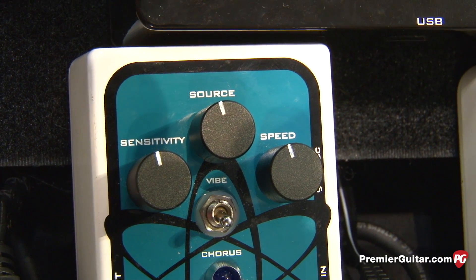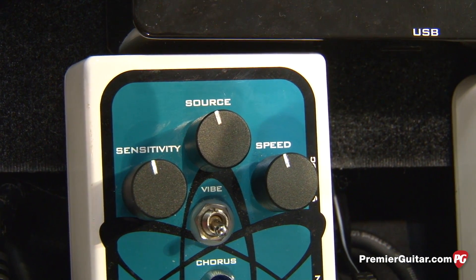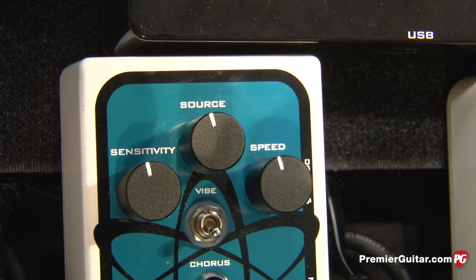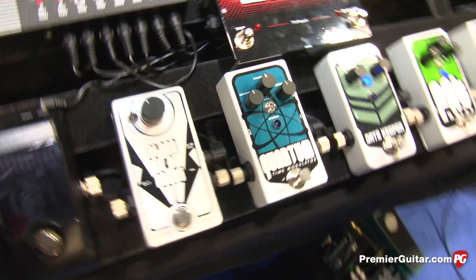I also wanted to include standard chorus sounds, but I didn't just want to make something normal. Some of my favorite classic chorus pedals are the Roland Dimension C, Dimension D, and the TC Electronics 1210 Spatial Expander that Dave Gilmour used. All those units have two chorus lines modulated in parallel. With the Quantum, we've got two all-analog Bucket Brigade delay lines in parallel in a unique configuration where instead of modulating in opposite directions, they do a little wave dance with each other. We've got an LFO and an envelope control, and a source knob to blend between the two.